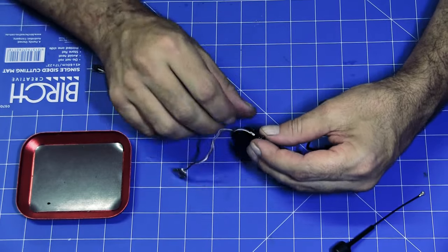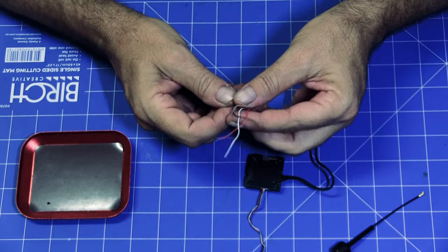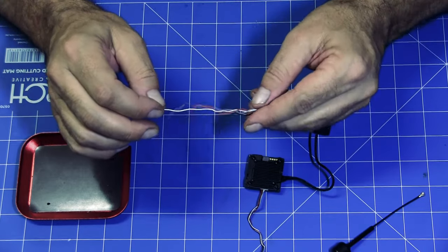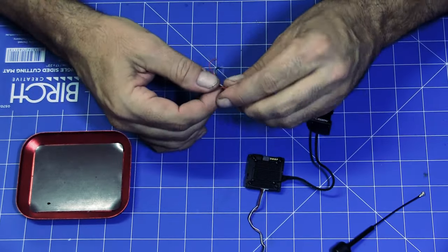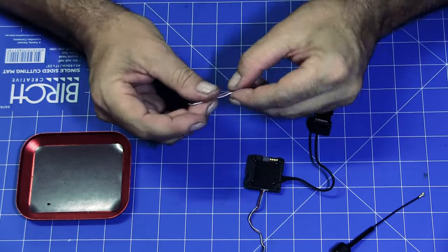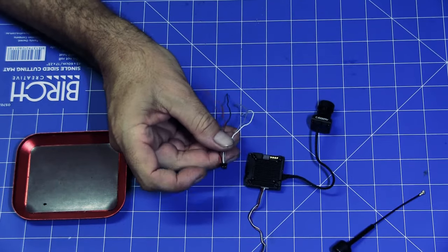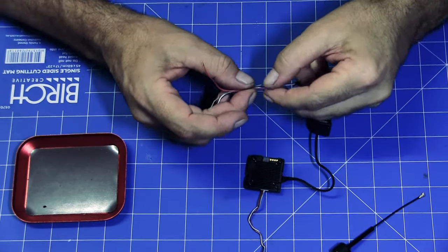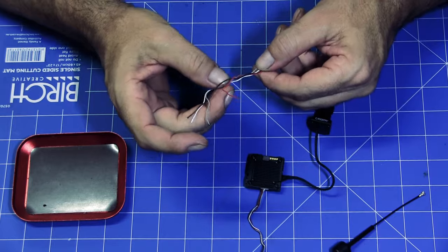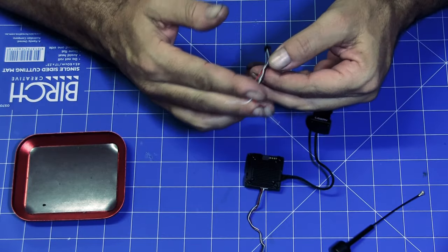There are two cables — one plugs in the back and the other goes to your flight controller. You've got four wires: power, ground, video, transmit, and receiver. I'm assuming the transmitter goes to the receiver on the flight controller and the RX goes to the TX — pretty much standard. I'm going to have a look at the Speedy B F405 wing, which is the flight controller in the FX61, and see how it recommends the HD setup to be wired up. I'm pretty sure it's just a plug, so I should be able to solder on the plug to this end of the cable and it should be good to go.